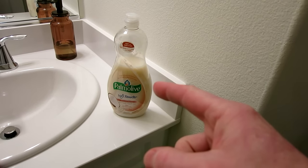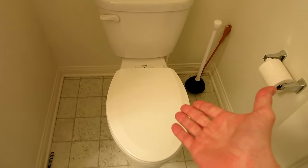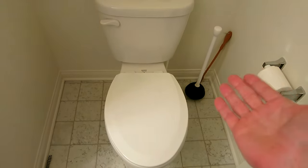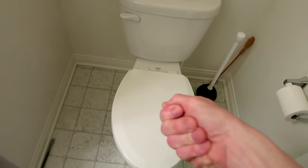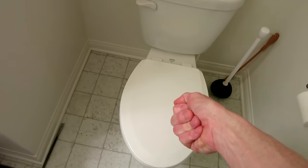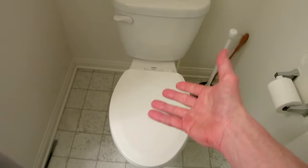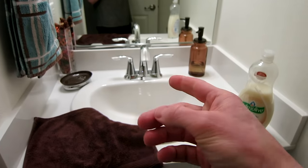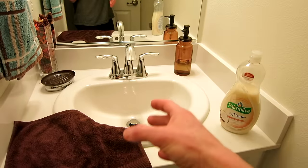You have some dishwashing soap — pick it up at the dollar store, real simple. What you're going to do is squirt the dishwashing soap into the toilet water. I do have a clog right now, but I'll save you the nastiness and open that up in a second. So when a clog does happen, squirt the dishwashing soap into the toilet water. Do not use boiling hot water — you could potentially crack your toilet. Use hot water from the sink or kitchen.